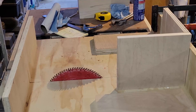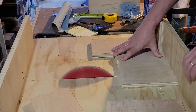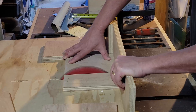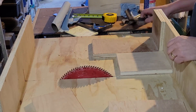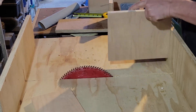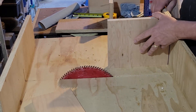So what I'm doing here as I've been rambling on — I'm going to take some scrap wood and make a little jig so I can add splines to that box. What I'm actually going to do is make a couple of mitered joints and test them out, like I did in previous videos, to see if any of them are any stronger than the others.